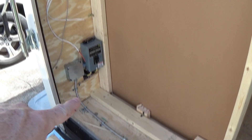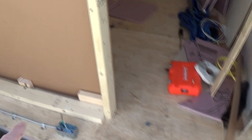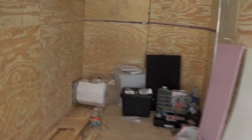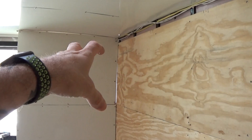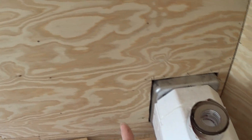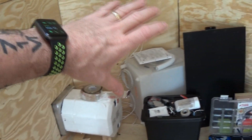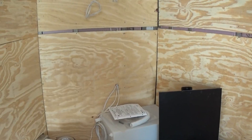Got the electrical in, and then a box beside it where I got my grounds. I ran a cable over and I'm going to put an outlet here for the air conditioner — it's going to sit here, hopefully. Went ahead and built a small little wall on this side. The shower stall is going to sit there and come out 32 inches. From there over will be the bed, and I'll build a cabinet around that water heater and around the water tank.